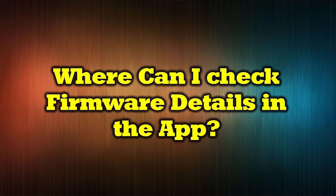The last question: where can I check the firmware details in the app? If you've been a pilot for any length of time, you know firmware is just a part of life. Companies constantly push out updates, and on a Saturday morning before you head out, a banner may pop up saying new firmware is available. My suggestion: before updating, go to the Autel website and read the release notes to see if there's something you really care about. Firmware fixes bugs and introduces new features. Also understand that firmware touches everything in the ecosystem — it loads on the quad, the controller, and possibly the battery — so know what's changed between versions.